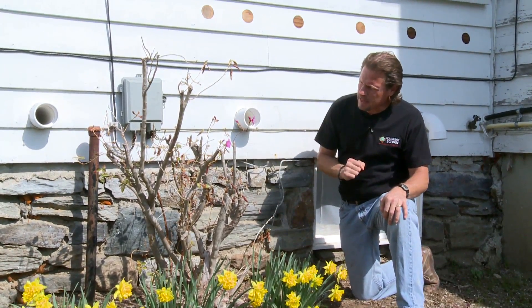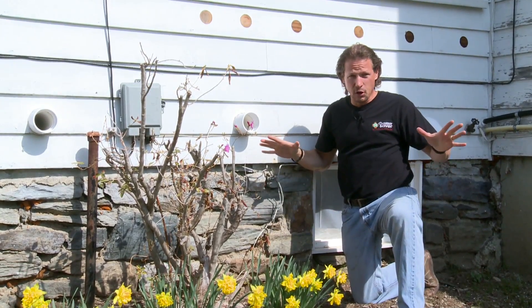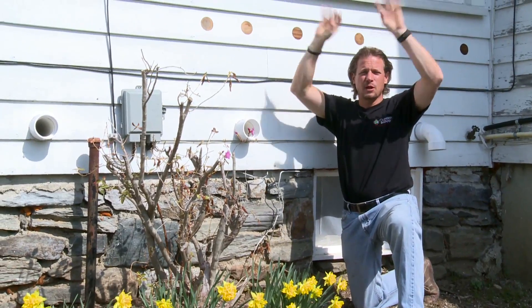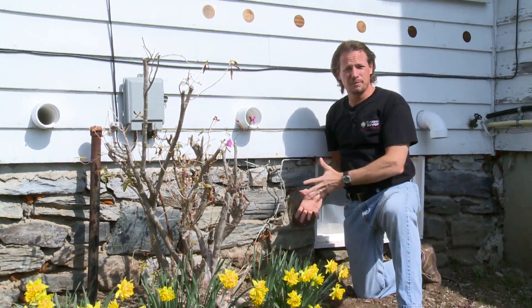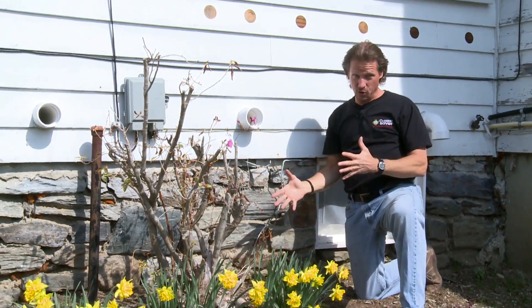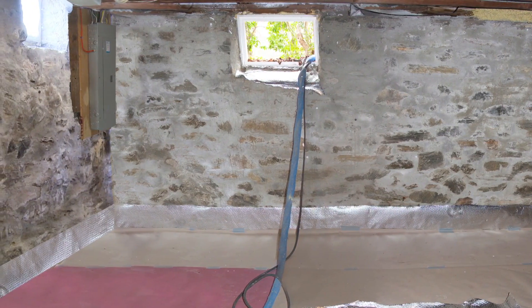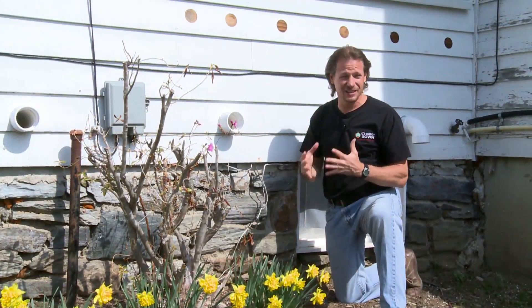So it's easy to keep a basement heated if we can prevent it from leaking. Houses have lower air pressure at the bottom — they suck air in at the bottom and blow air out at the top. So we're concerned about air being sucked into the bottom in the wintertime, freezing cold air. Here we see a stone foundation wall, and stone walls of course are just individual stones with some mortar in between, and they're imperfect and they leak a lot of air.